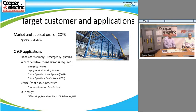that we've been offering. And like Matt said, the Cube Fuse has been on the market for more than 20 years. It's been proven to work just as effectively as all the other fuses, which is tremendously well. The Class J has been around since the late 40s, early 50s. So that type of protection has been around for a long time, and it's been proven. And we have all these different applications where it can be used because it's just a smaller footprint, and it's got all these other safety advantages that go along with it because it's finger safe and because it's size rejected. And some of the QSCP applications that we were talking about before, obviously it applies here as well.